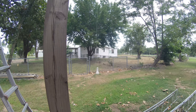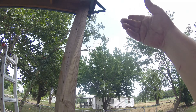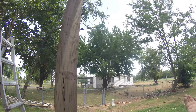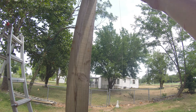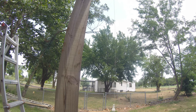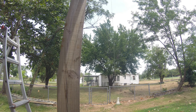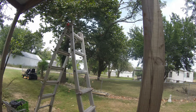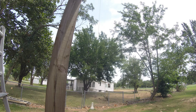The way it's going to work is I'll have a cable with a pulley up there. As you can see, I've already mounted the top piece which has got that V-notch. The idea is once you bring the tower up, it'll notch into that and the cable tension will hold it there. That will support the tower, and I might just run one guide wire over to that back pole just to hold this side.